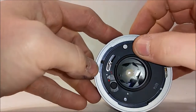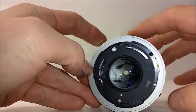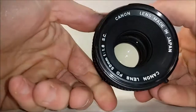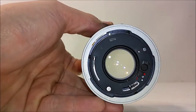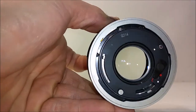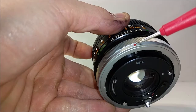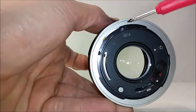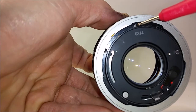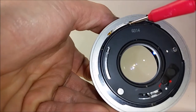So here you'll see the aperture blade. It's a little oily. I'll reset it back — that's the way it was. This is how it'll come; here's the orientation. There's a tiny little silver metal pin that you can barely see. It'll be right here by the red dot that you line up on the camera when putting the lens on. So you got this hard thing that doesn't move — this big circle right here does not move. It's this to the left of it, right there.